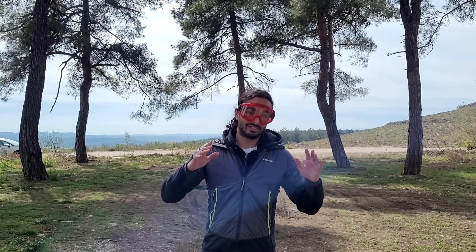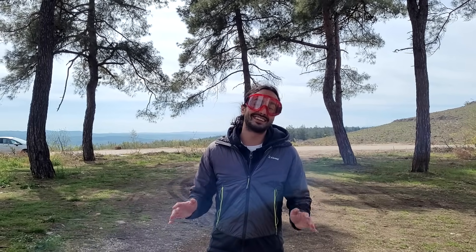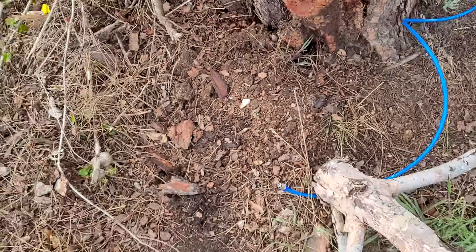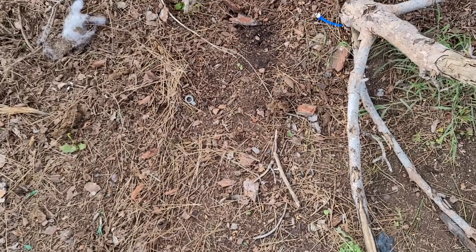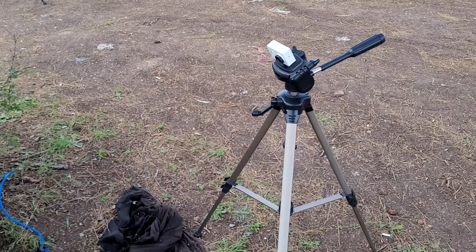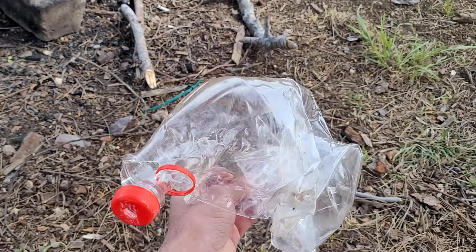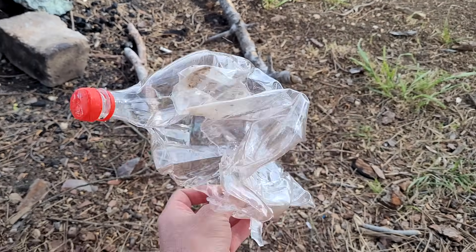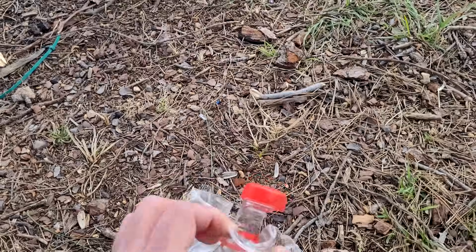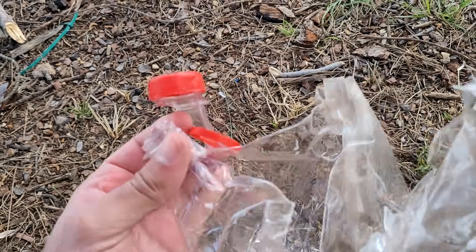Luckily we're in some place really stranded — there's nobody here. If I did this in my home, the whole apartment could have called the police. It was so loud. The pneumatic fitting is here but the bottle is not. At around 150 psi it exploded. Unfortunately my camera here wasn't filming so I'm not sure if it got the explosion. But the bottle is here — when exploding at 150 psi it becomes completely mangled. I think it ruptured from the side and it was so violent that even the cap part is broken — the hard plastic part is not stretched so it's much thicker and harder, and even that broke completely.